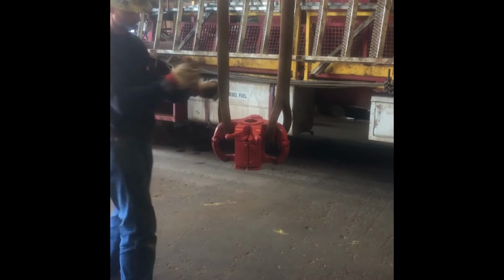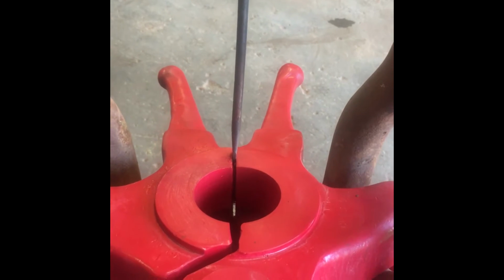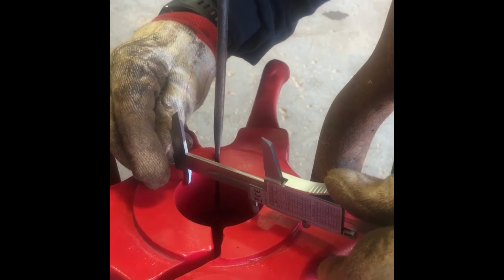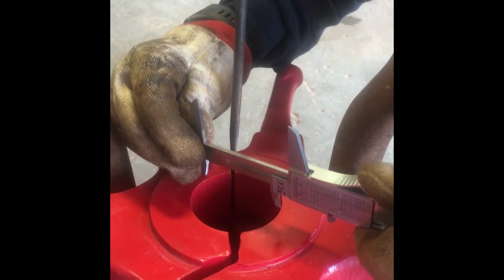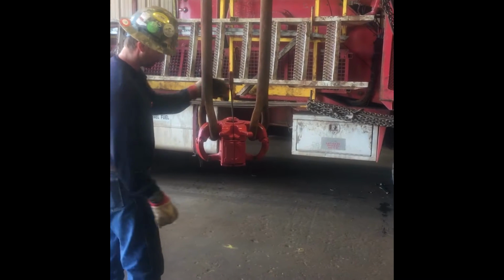With the elevator door closed, ensure that the latch mechanism is properly engaged with the locking lug. Insert a wedge between the right and left half. Using a micrometer, measure the diameter of the elevator bore hole. Maximum bore diameter for a 2 3/8 elevator is 2.746. Using the latch mechanism and normal pulling pressure, attempt to open the elevator door.